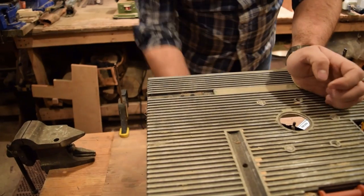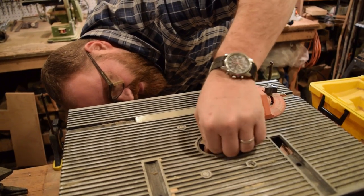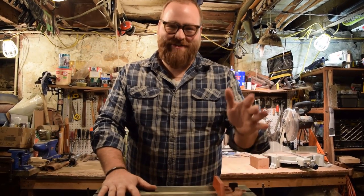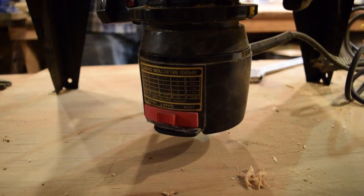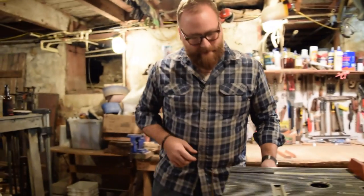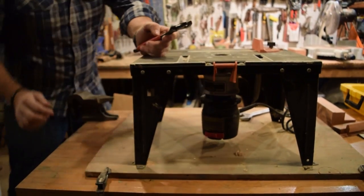I can't find the stop on this. We found it — or I should say my brother Devin found it. There is a lock shaft mechanism in this router, and it's on the other side, facing you guys, which is the reason why I couldn't find it. So we'll lock the shaft, and then we'll be able to loosen it and pull the bit out so I can put in the bit that we want to use. Now it's locked, and now I can actually get into it and loosen it.